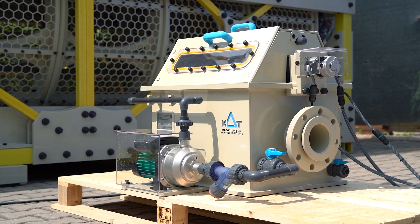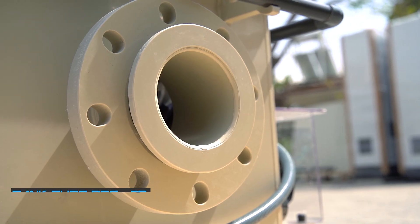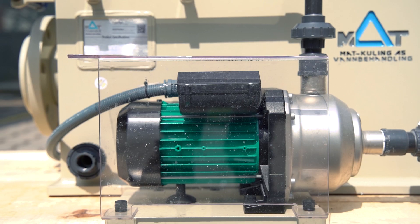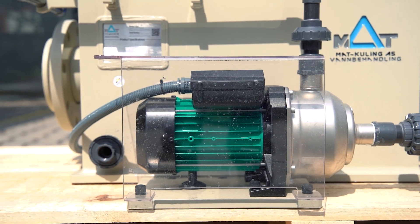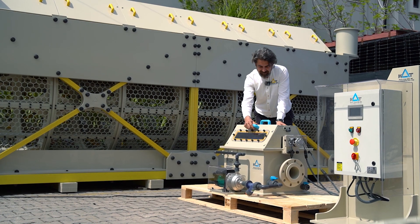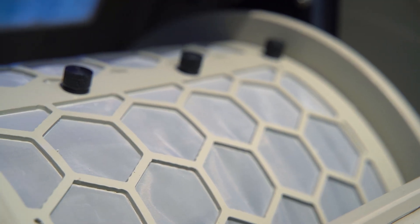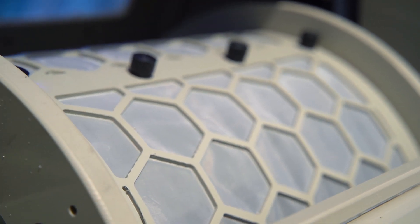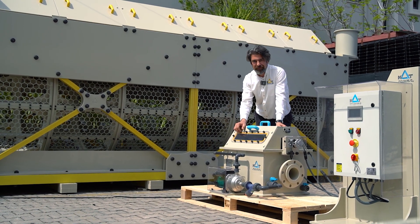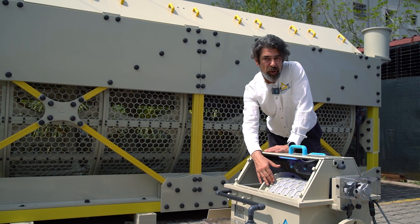We can start with our smallest equipment on our DRF series — DRF 25, a micro drum filter for small flow rate applications up to 35 cubic meters per hour. This tank type unit is made of recyclable and food grade polypropylene with two observation windows and service lid on both sides, and also service lights inside for ease of inspection during operation. The filter mesh that you see is 100 micron food grade polymer.